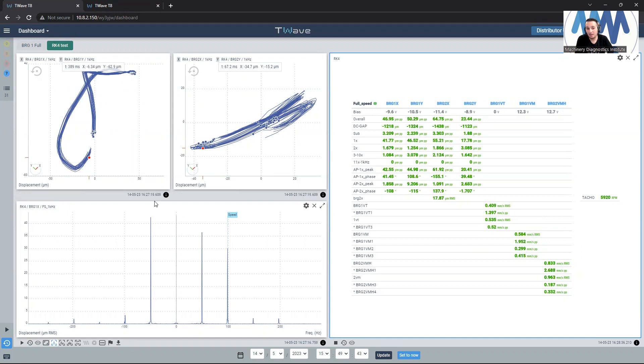That's how the rubbing affects the orbit and the full spectrum. You can see the running speed 1X, half of the running speed in the forward precession, and half of the running speed in the reverse precession with higher amplitude — that's why we have reverse precession here. This is a smaller 1X on the reverse precession side. The bearing number one is pre-loaded. If you would like to see more information about rubbing, whirling, drop eccentricity, pre-loads, misalignment, unbalance, electrostatic discharges, shaft crack, surge, stall, and many other faults, please feel free to join us in the advanced turbomachinery training. Thank you very much for watching — your feedback and comments will be highly appreciated. Hope you enjoyed the video — see you next time!